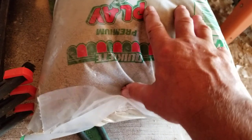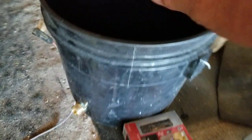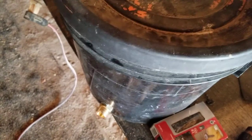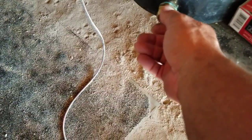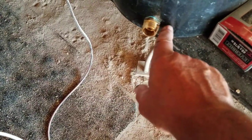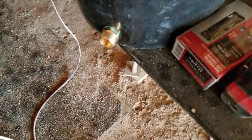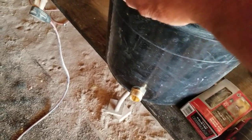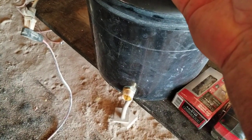Once I get the sand clean so that when I put clean water in it stays fairly clean, I'm going to put about a two-inch layer of sand over the top of all of that. Then my cover will snap back on. Down here at the bottom I've got a male connector on the hose connection - half-inch pipe thread drilled through the plastic, coated with my favorite true blue sealant and sealed in place. So this is basically a waterproof unit. When I snap this cover down with water in here, I could turn this bucket over and there were no leaks.